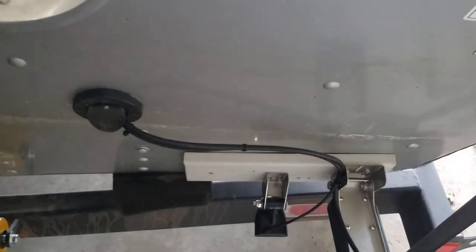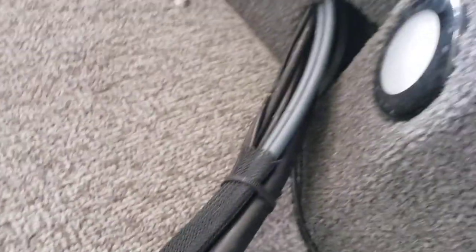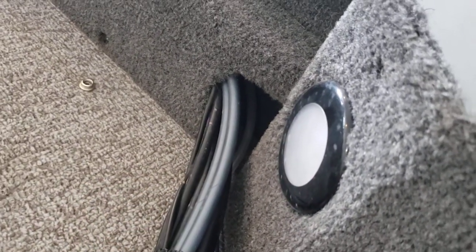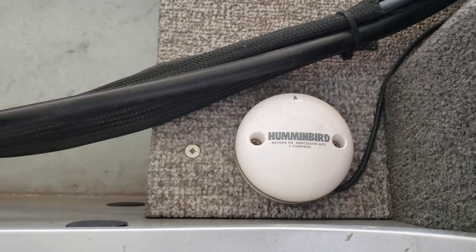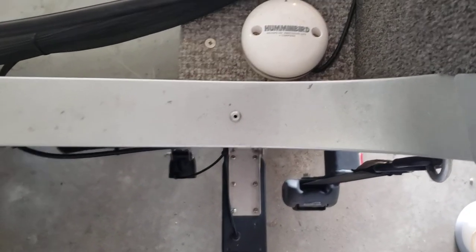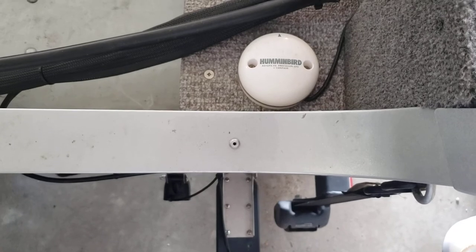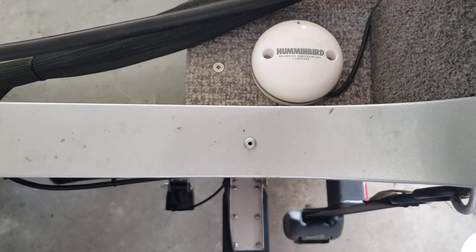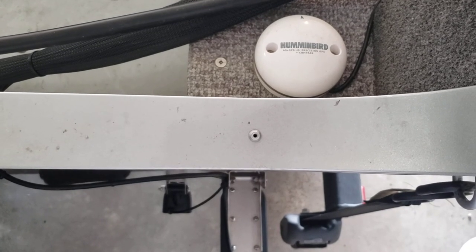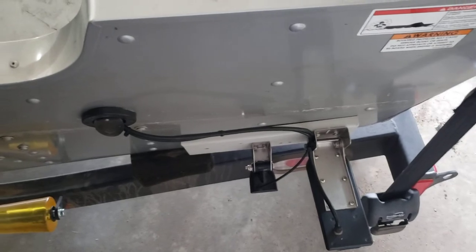You'll see that my cable routing is nice and clean. Some folks don't like that I come up through these little flaps on the bilge, but water comes in there and goes back out there too — I'm not that concerned about it. So the cables all go up right into here along with the throttle cables and all that other stuff. Here's my puck — we were looking at that from the driver's seat of the boat. I could not get that puck any closer to the location of that transducer unless I mounted it on the top of the transom itself. I just got to remember to make sure it's selected on the graph while I'm recording. For those of you that were curious, I did manage to save at least some of that data, but most of it was garbage and it's going to need to be redone.